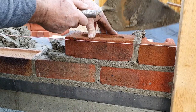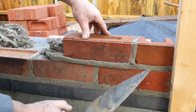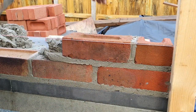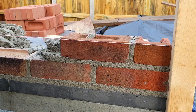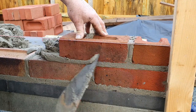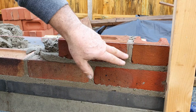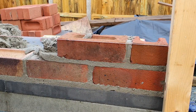Yeah. I'm over exaggerating, but that's because I'm trying to show you, that's all. Yeah. I'll do one more. I'm going to scrape on the gear, there's no mark on the brick. One more little tap. Like, now the big time brickies out there will say, nah, you're tapping too much, but this is just to get a start. You don't stop tapping. So that's quite nice, look. Yeah. Bit fat. I'll do the next one, try and get a bit thinner. Then I'll let you get on it.